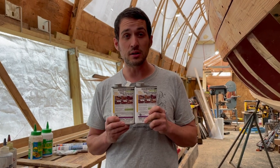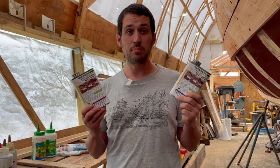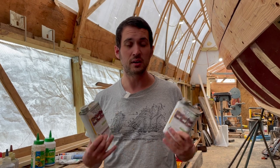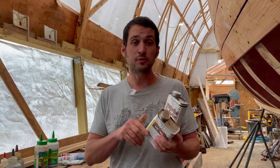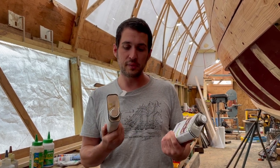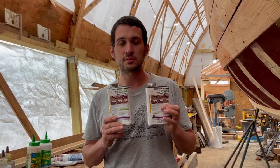If you have something that's rotten that you're not in a position to fully excavate, if you pour a bunch of this in there, it will actually suffocate whatever spores are in there. It won't be able to breathe. It will be fully encapsulated in this stuff. The stuff will work its way into any open pores, any open crevices. It's very, very thin and it will find its way in. So this also has its applications. Thank God, not every day though. Oh God.